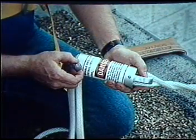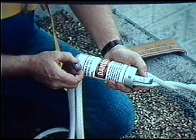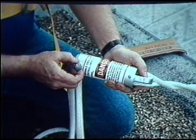After wrapping the Sky Genie to help control the weight you are, replace the cover by pressing in the detent pin at the bottom. Then, tighten the thumb screw at the top. This must be done, or the Sky Genie will not operate safely. Your life depends on it.